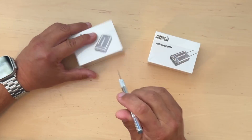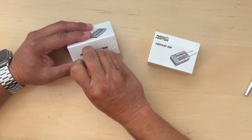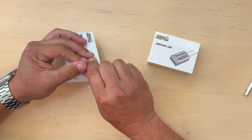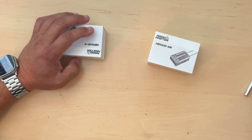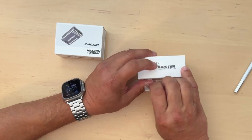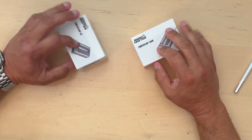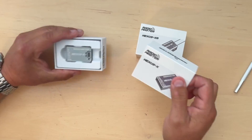These units are basically an upgraded version of the original Nexus with more ports, more features, and both units are powered by the STM32F722 MCU with the highly accurate ICM42688P 6-axis MEMS motion tracker. Both of these units have an integrated black box with 256 megabytes of flash memory, offering plenty of space for flight logging, allowing for easier flight tuning.